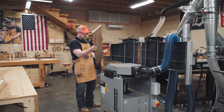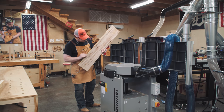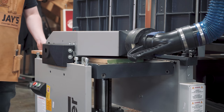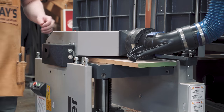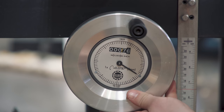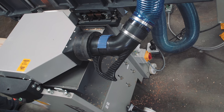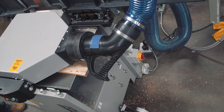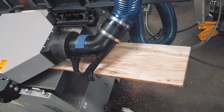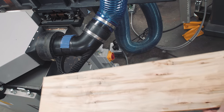The only piece I had left was already planed to 7/8 of an inch thickness and unfortunately had a little bit of bow to the board. Rather than chasing the bow out at the jointer, I decided to just skip plane it down to the final 3/4 of an inch thickness. My thinking was that I would rather have a full 3/4 inch thickness and a very slight, probably unnoticeable once assembled, bow on the final pieces.